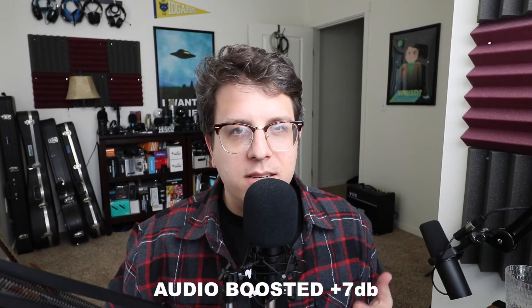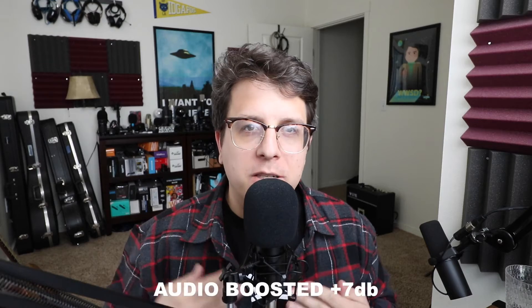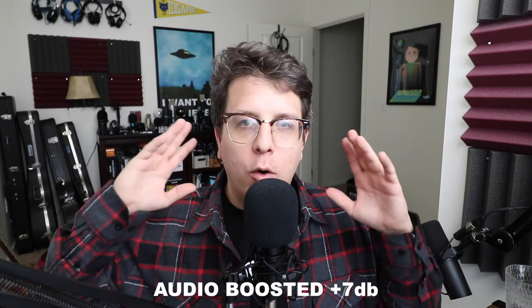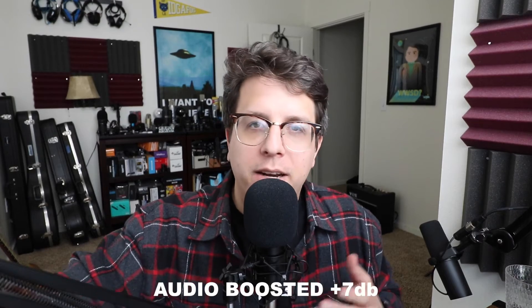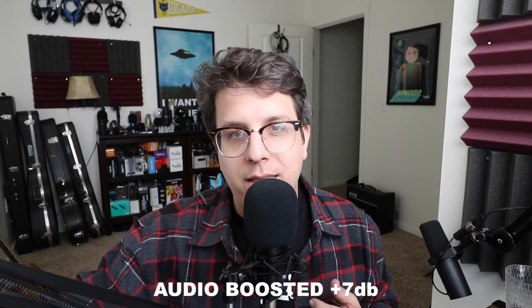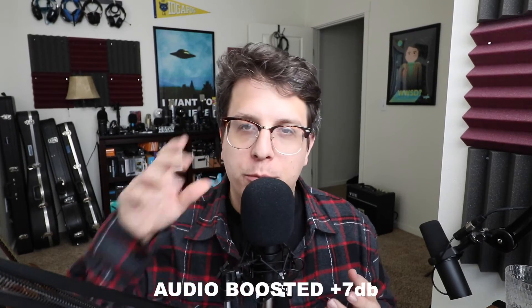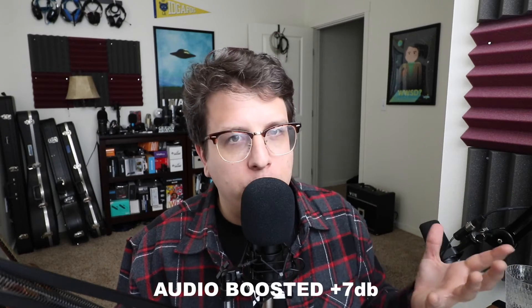In conclusion, it's a decent sound card. I don't think it's sufficient to work with an electric condenser microphone alone. If you're going to use something like the NW800, NW700, or any other electric condenser microphone, I think you should and probably need to invest in an external phantom power supply, which I'll link in the video description. For a dynamic microphone it does work, but you still have to set your gain at 100% to get a decent volume, so you're still going to be battling background noise.